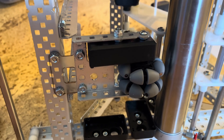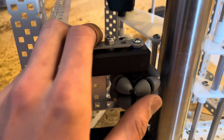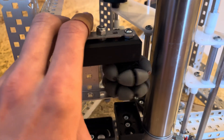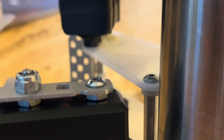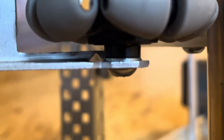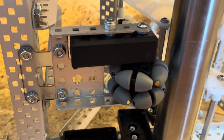This is the tracking wheel we are running on our Worlds bot. It has a very low friction pivot because it's a screw joint — a structural screw joint. You can see it's sandwiching the one-by there and also on the bottom, which just makes it really strong and really low friction.